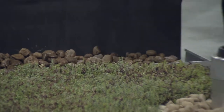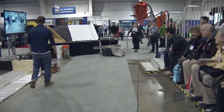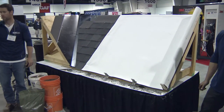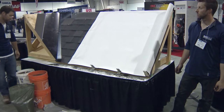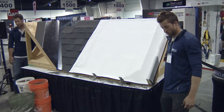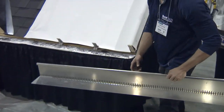A sloped green roof application starts from 10 degrees and up. There are three critical elements for a sloped vegetated roof. The first is shear forces — the entire system wants to slide down to the lowest point. To counter shear forces, shear barriers need to be installed at the fascia as well as at intermediate points for longer roofs. There are two types: wood blocking creating little curbs, or a perforated steel edge with support brackets at the bottom of the roof. Other systems use a cable or netting structure fastened to the top of the roof. The brackets need to be waterproofed in.